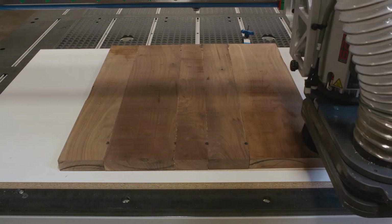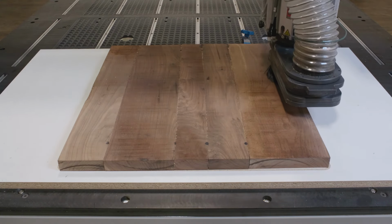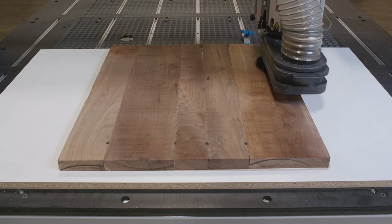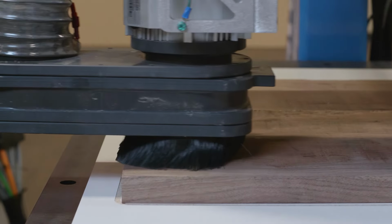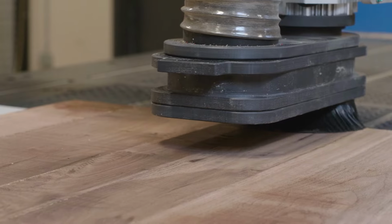If you're careful in aligning the boards when you glue the panels together, they can usually be held by vacuum if you use a gasketed fixture. If not, you can screw them into a panel to keep it from moving as long as the screws don't extend above the surface. Once you've machined that flat surface, then you'll be able to hold the panels with vacuum.